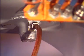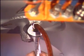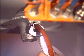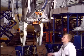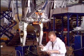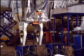The nitrogen pressure which is inside the shock absorber aids the drainage. Once the shock absorber is empty, close the inflation valve and remove the flexible hose.